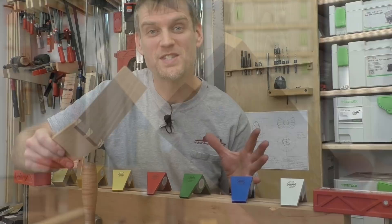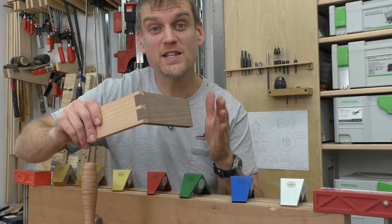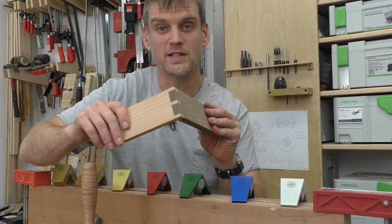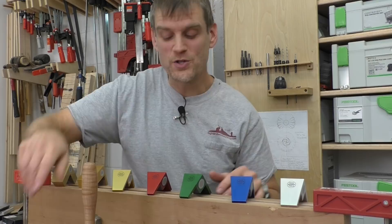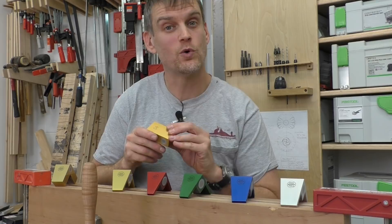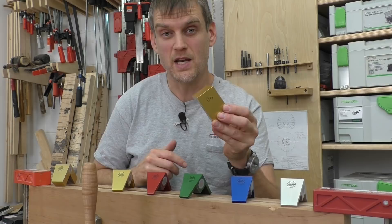The reason for the accuracy is because it lines up the saw exactly where you need it and makes a perfectly straight cut at the correct angle. So there is no paring with your chisel or a way to accidentally overcut, and you get dead-on accuracy for each of those saw blade cuts. Here is the whole range of different guides you can get, from 1 in 4 all the way through to 1 in 8, plus the 90-degree which I used for the shoulder cut. For shoulder cuts you can just go straight up and down without a guide, but the 90-degree is pretty handy for making sure you are dead-on.